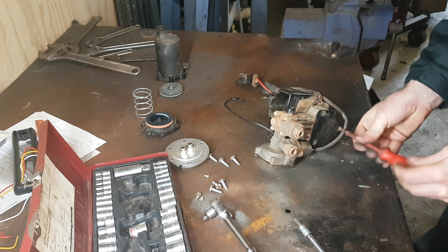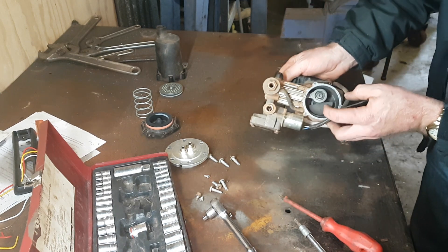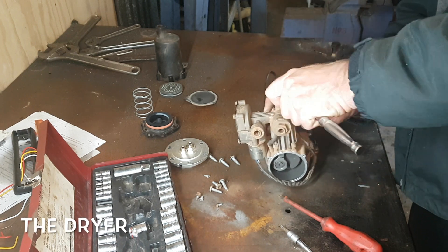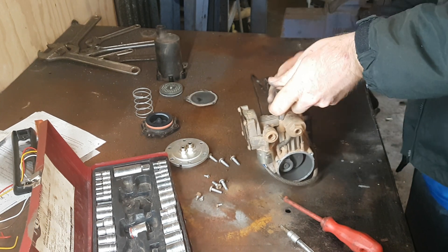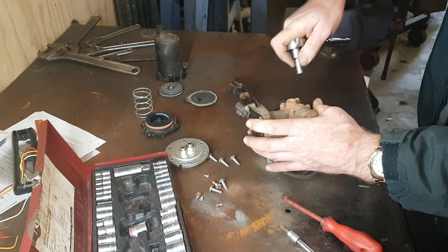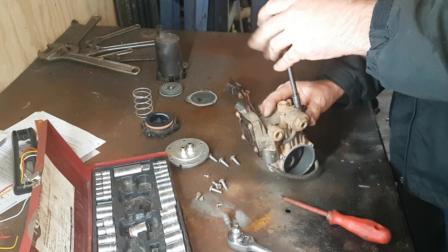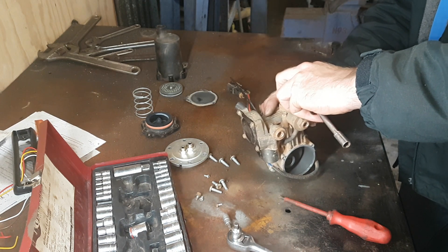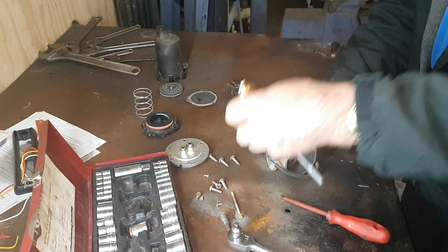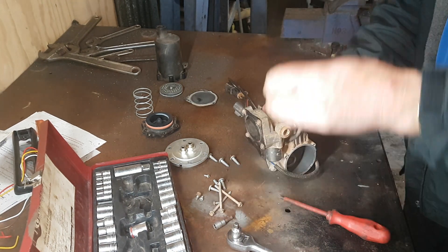You can see there's just a bolt in there. Now that we've got the discharge away off the compressor, I'll just pull that head off — it should be just these four bolts here and the whole lot should just lift off. When I replaced this one, I went for just another Hitachi style. I ended up putting the Dunlop one on, mainly because at the time it was a bit cheaper. I had the option to replace it with the AMK or stick with the Hitachi style — I chose to stay with this one, mainly because I had the option to rebuild these, and I think these are a bit more rebuildable than the AMK.